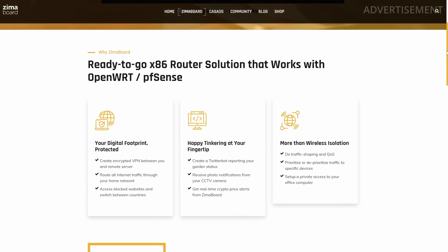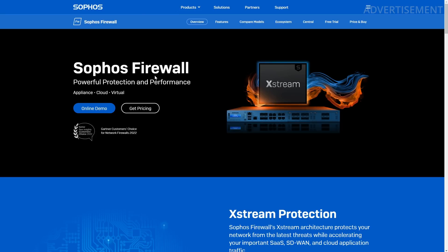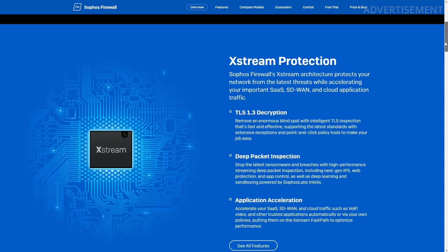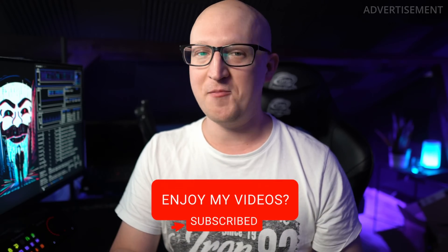There's also another idea I had in mind: this board is perfect for firewall systems because one feature not many devices in this size offer is two ethernet ports. With firewall systems, you typically want to use the first port to connect to your network switch and the second one to connect to your router or uplink device for internet access. This makes it perfect for building a custom home router and network firewall with an operating system like PFSense, OPNsense, or the Sophos XG Firewall. I'm a big fan of Sophos XG — I've already made two videos about it.